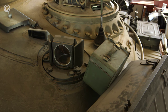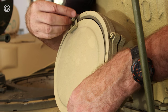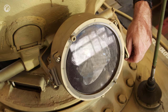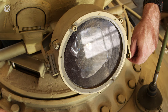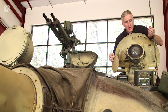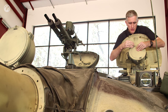We're back for part two of the T-55A. Going back briefly to the infrared sight — it always has this cover on it that you have to unscrew. It takes a couple of seconds, but you're not going to be doing this in combat under fire anyway. You can now reveal the searchlight. It is a simple searchlight with an infrared film on the inside of the lens. Very simple system — not the most effective range, a few hundred yards, but certainly better than nothing or better than using your simple night vision sight without the assistance.